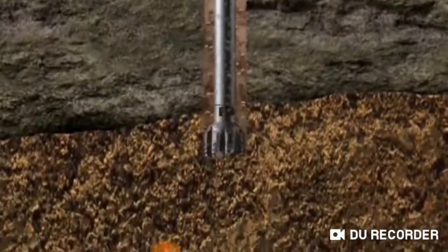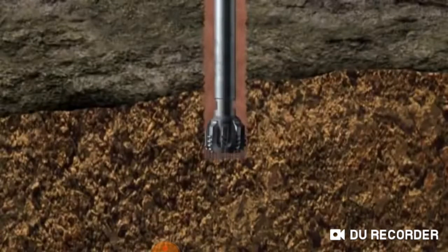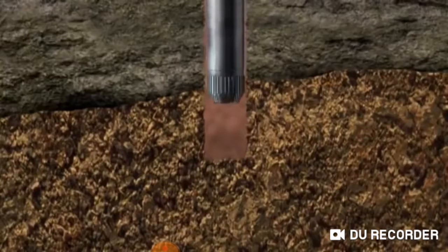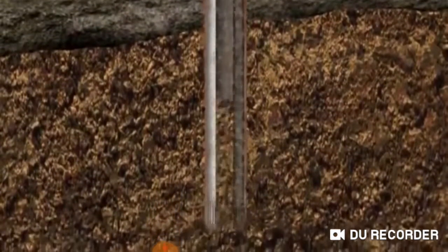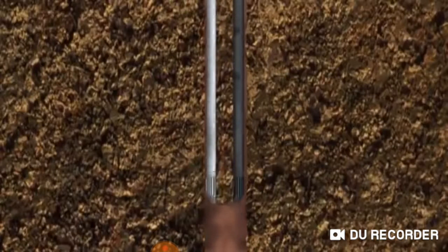When the well penetrates a potential reservoir rock, the oil or gas may be detected by analyzing the drilling cuttings for traces of gas and/or oil. At this stage, it is essential to gather as much information as possible about the reservoir. Two methods provide most of the information. In the first, the drill bit is replaced with a diamond-studded coring bit at the bottom of a core barrel. This can cut a complete section of the reservoir rock and return it to surface for detailed analysis.